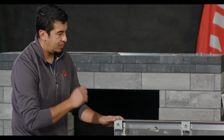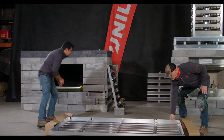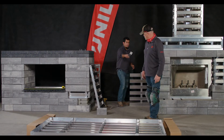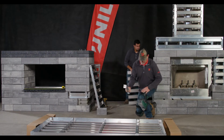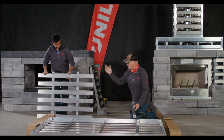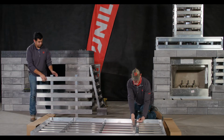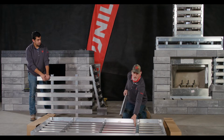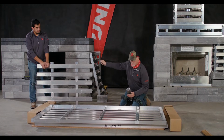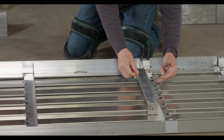The easy way to do that, Bruce will help me here, we'll lay this back down, and I'll bring over some hardware for Bruce. Here you go. Corner bracket. If you're going to panel that backside of that opening, we'd attach that here along this rail with some self-tappers. Now recognize this is where we saw cut that opening out. Auggie's holding that cutout off of that cabinet. To reattach it in the back, we'll simply do a self-tapper here on the sides.